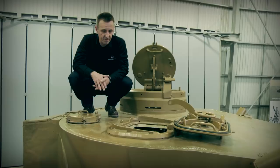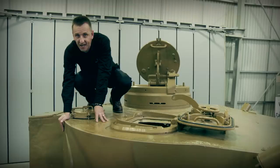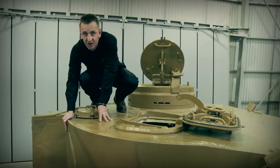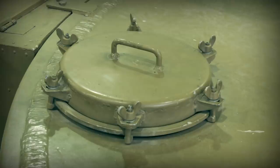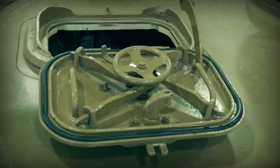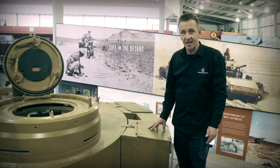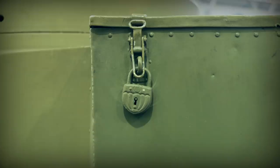Moving up on top of the turret, the first thing to notice is the emergency or escape hatch, located on the rear right-hand side of the turret. Incredibly heavy and a bit of a design problem — once it was open it would just drop away, opened from the inside, but it needed somebody on the outside to push it back into position again. On a lot of records, they actually used that hatch for re-stowing ammunition on the Tiger 1 — it's quite a quick way to put ammunition through there and straight into the turret. We've also got the armoured cover for the ventilation fan, which provides ventilation for the crew inside. And a very simple design for the loader's hatch — two positions, or it could be just left ajar to allow some air in. Notice the hefty rubber seals around the hatches. Located on the back of the turret was the only stowage on Tiger 1 — quite a small bin containing tools and crew belongings. Quite an interesting thing about Tiger 131 is that it has the original padlocks that came with it, which is obviously very unusual.